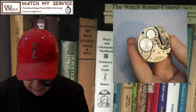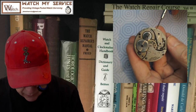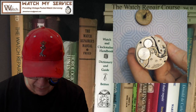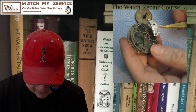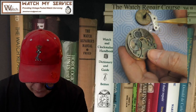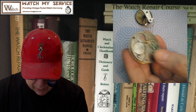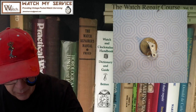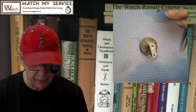The first thing you do when you take a balance off after removing the movement — there's a very small little groove in the back here and you stick your screwdriver in the groove and just twist it, and that'll raise the balance up. Then you position the balance cock very close to the watch and you lift the balance out of the pocket watch by tilting the movement slightly. The balance is tucked under the center wheel of this watch, and then you very carefully rest it on the balance tack. I'll place the watch back in the case so it won't get damaged.